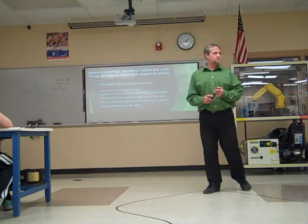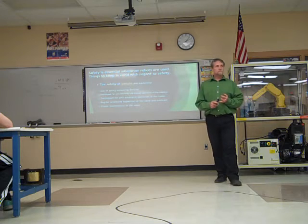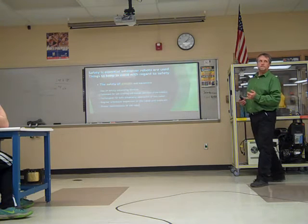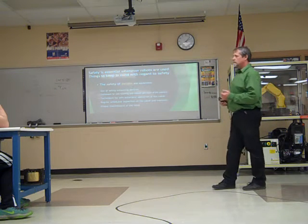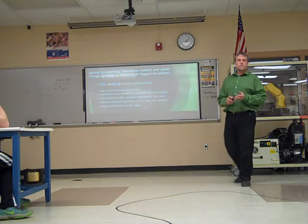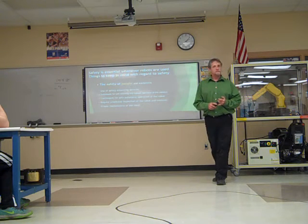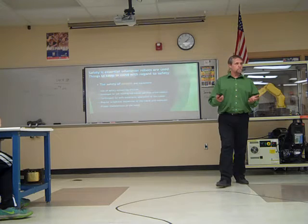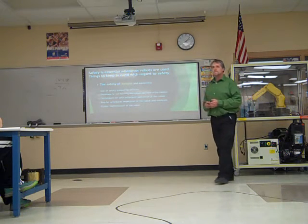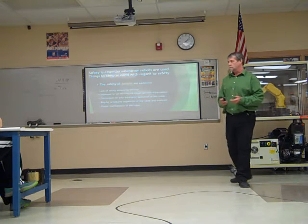Safety enhancing devices. I think that might be dead man switch, emergency stops, things like that. And maybe some things that you maybe haven't heard of or seen before that you might encounter in a factory. We'll look at techniques for safe teaching and manual operation of the robot. Things that we should do and shouldn't do when we're teaching, or when we're done teaching and we're running it for the first time to see what it's doing. Techniques for safe automatic operation. What should you do? What can you do? What are you not allowed to do when it's running in auto mode?